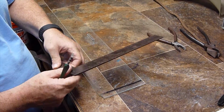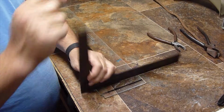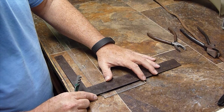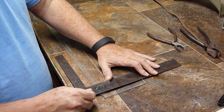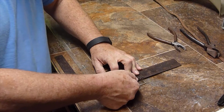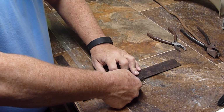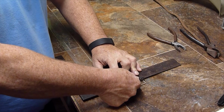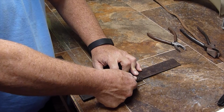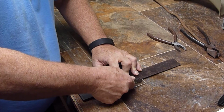What I'd like to do is use a T-square to make sure I'm getting the right cut. I want to make sure I'm cutting in the right spot on the outer edge of my line, where I marked it. This is the tricky part now. You have to apply the appropriate amount of pressure. You start behind the edge of the glass, and listen to when I score it. I think I got it all.